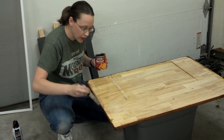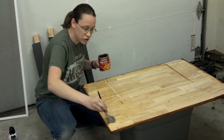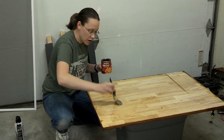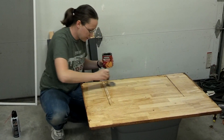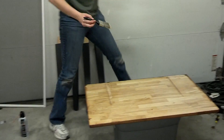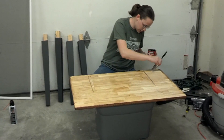I'm trying not to go over the edge to affect the finish on the actual table top that I did earlier. You just want to go over this and get it in there so the wood can drink it up and get ready for stain. The important thing is it helps prevent blotchiness and it kind of helps hide some of the natural imperfections on the wood. Other wood imperfections are things like scrapes, cuts, or crayon marks, which every parent knows about.